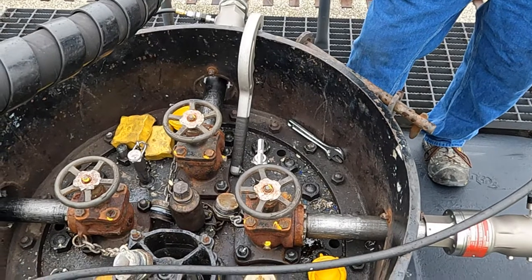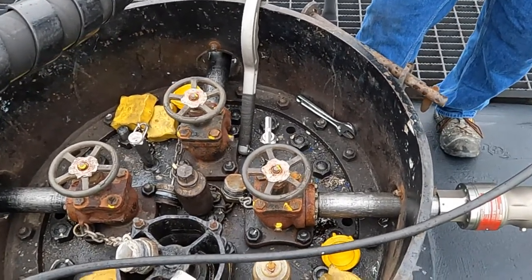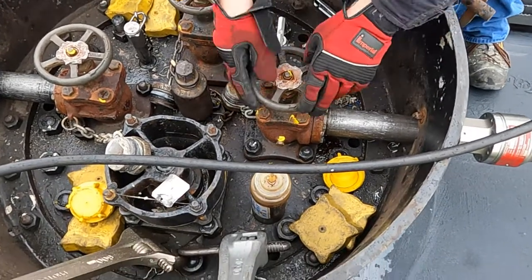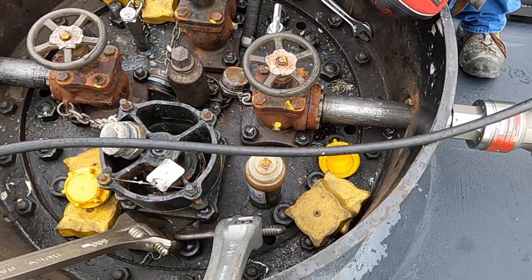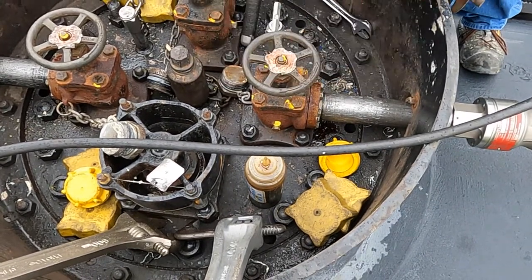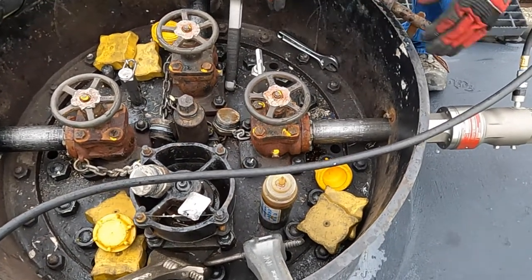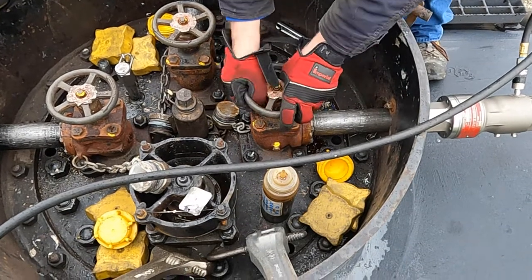The Midlands are the ones we have the most trouble with. They are the ones that just can be your most difficult valves. But anyway, when you're shutting off, you take it down to where it seats, and then you snug it. That's it — no more, until you have proof that it's still leaking. That's all we want to do initially.